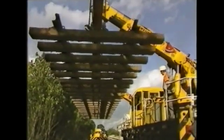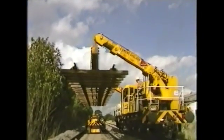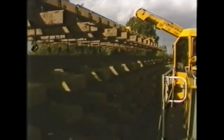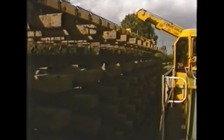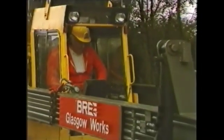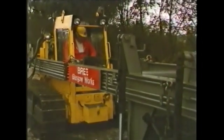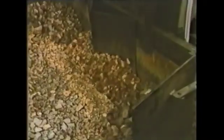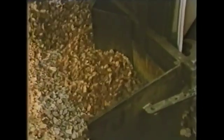The old track is carried back for stacking at the loco end of the materials train. The size of the grader is an important feature — it is low enough to be cleared by the loose sleeper beam and its load. This applies both in twin-jib and single line gantry work. Once the panel of old track on the beam is clear, the grader can proceed to level the ballast. The driver has a clear view of the blade from his cab, from where he controls the blade and keeps an eye on ballast buildup in front of it. With the grader smoothing the ballast, the shape of the blade may be varied by the driver. He can alter the depth of the central and side sections from his cab, although the blade depth over the rail seat area remains constant.